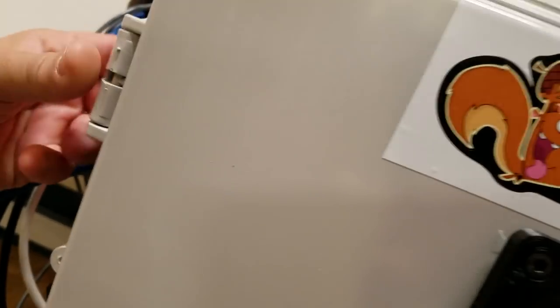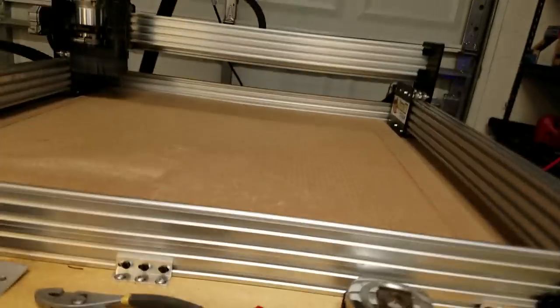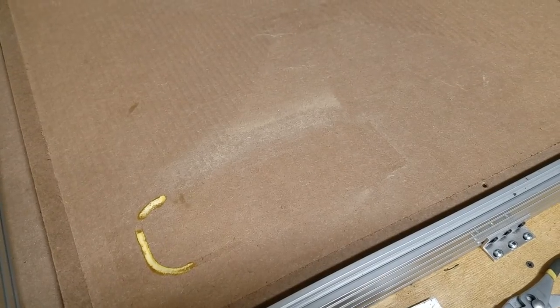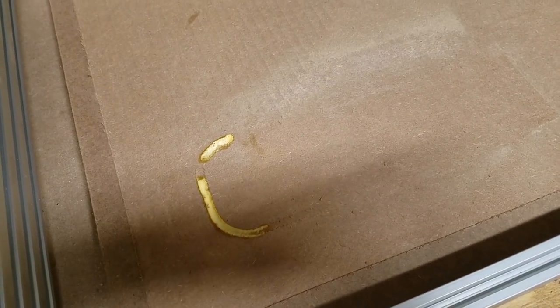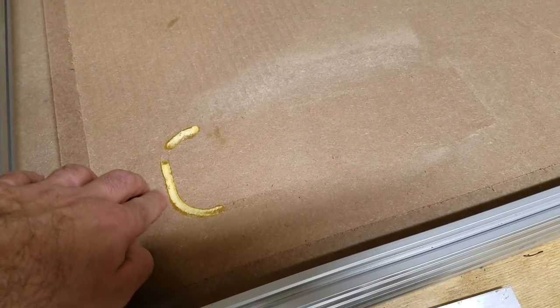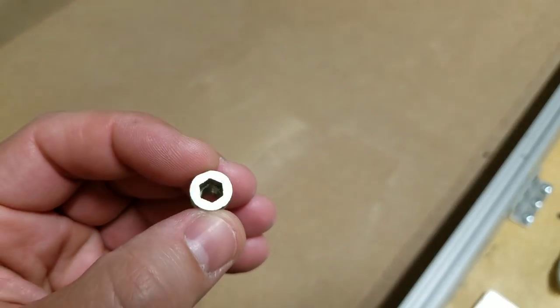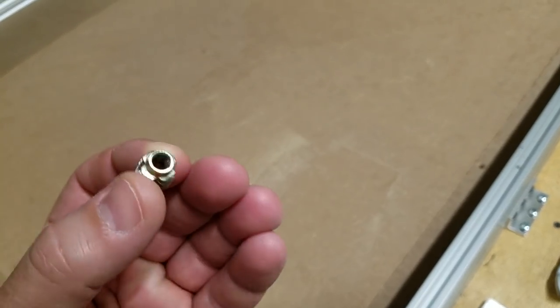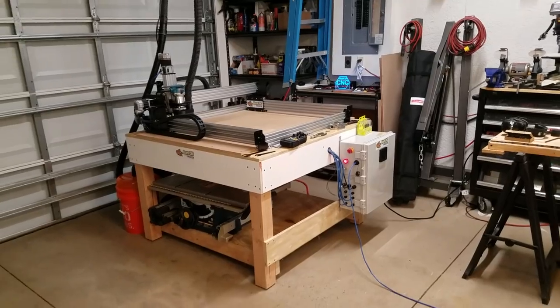The router is coming along, it's almost done. The next thing I'm going to do — I used double-sided tape when I did my test cut. I had a little situation: I didn't have my bit or collet tightened up good enough, so my cutter slid out of the collet and cut into my table. We'll deal with that later; that was my fault. What I'm going to do next is recess these T-nuts down into the spoilboard so I'll have a place to put M6 fasteners to hold things down. That'll probably be the next thing I do. Thanks for watching and be safe.